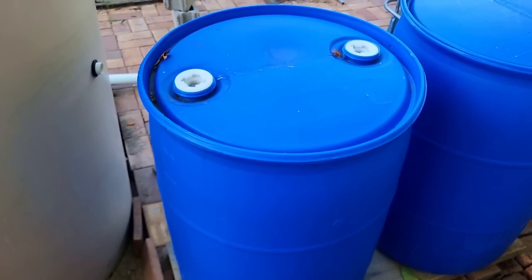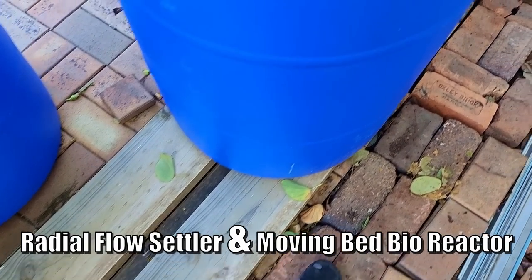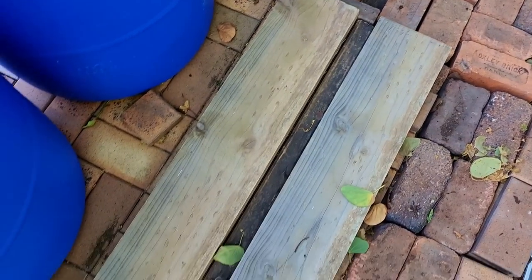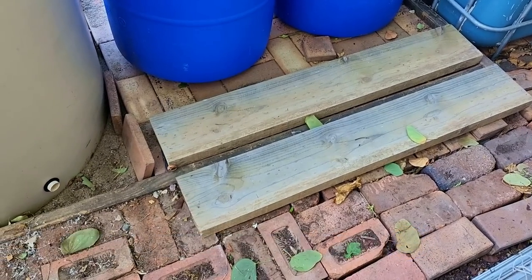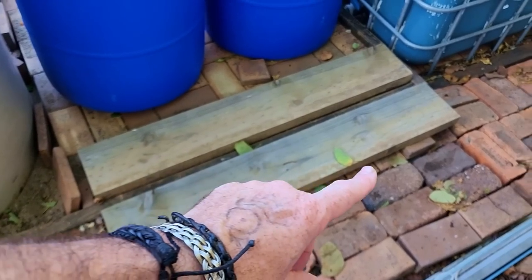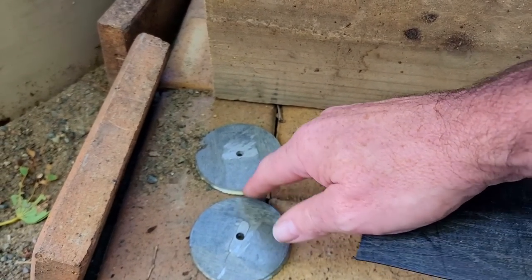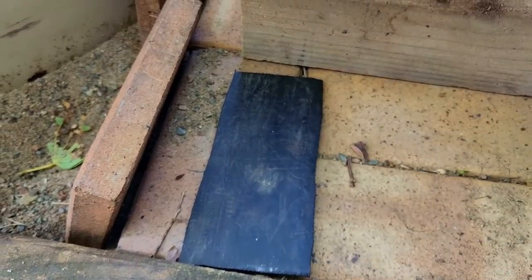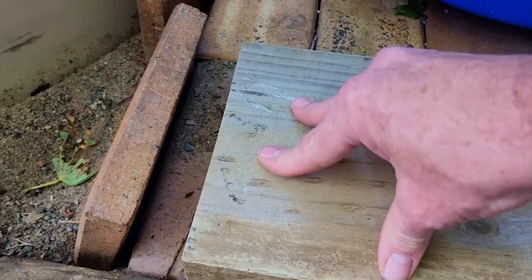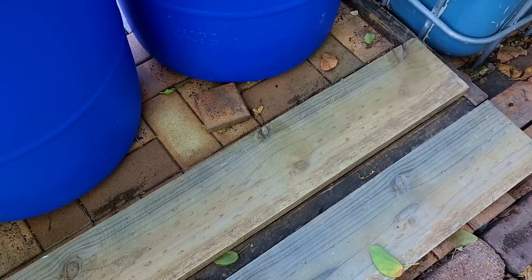The drain work is now in and I could work out the levels to drill the holes for the radial flow settler. But before I do that, I thought I'd show you what I've done to hold the radial flow settlers in place. Down here we have a couple of 50mil or two-inch by about eight-inch or 20-centimeter sleepers, leveled using some packing bits and pieces - nice and level. I'm using little scrap bits of plastics as shims to keep them off the ground because these won't rot, and I've also got some aluminum discs - just offcuts - just to create a firm base for the sleepers so they're nice and solid.